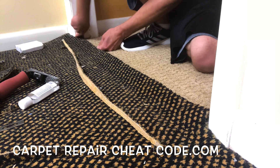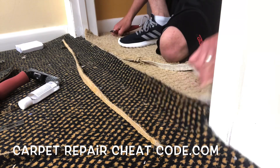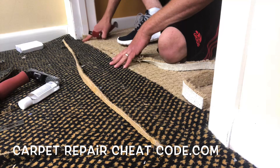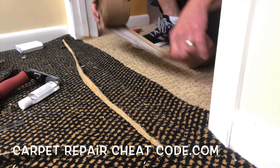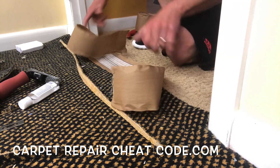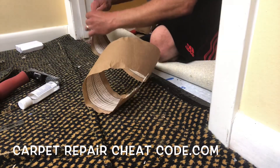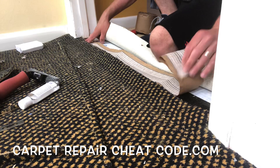We went all the way through fast, quick, and easy. We'll fold that back, cut that little bit off there, go over here, cut that little bit off there. It looks like we're in pretty good shape. Let's go ahead and get the seam tape — we're going to roll that from door jamb to door jamb, tear off the excess, and we'll have about four inches collectively extra on that seam tape. We want to fold it under at each end to sit it on top of the little pieces of tack strip in the doorway, and that's going to bump it up just enough to get a nice even burn from the seam iron.